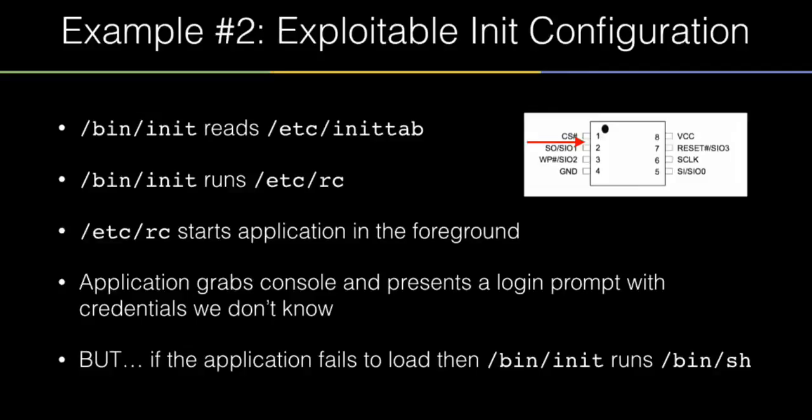This is also an example of a serial flash device. These typically have an eight-pin pin-out, very standardized, much bigger device physically, so you can use a multimeter probe to poke at it. I was poking between the chip select — which says 'hey flash device, read me out some of that data' — and the actual data output on that.